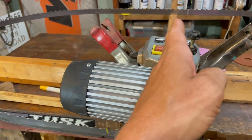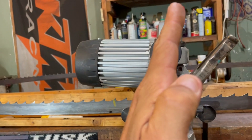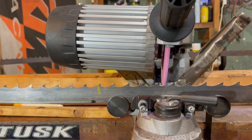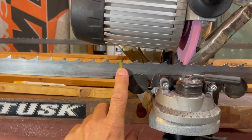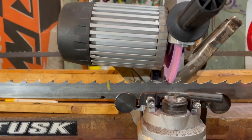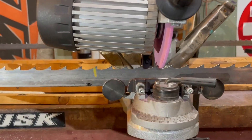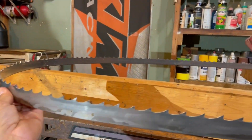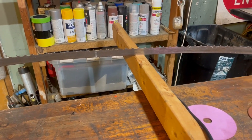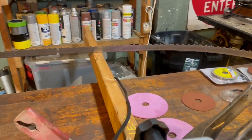I contoured the stone face — just this face, not the side — so I could get as deep down in the gullet as possible. As you're moving, you slide it gingerly forward, then lift the mechanism with a stick on your knee, raise it, move the blade forward and lower it. For settings: 90 degrees perpendicular to the jaws, then tilt to four degrees — or seven degrees for a seven-degree blade — just match it to the blade. When you start, make a mark so you don't resharpen the same tooth twice. Don't bear down too hard or you get that bluing effect.